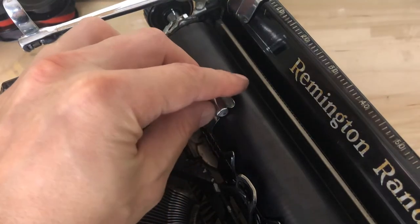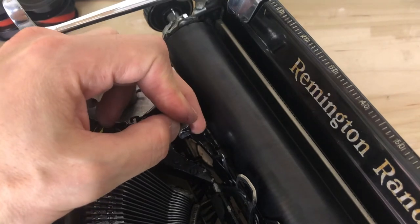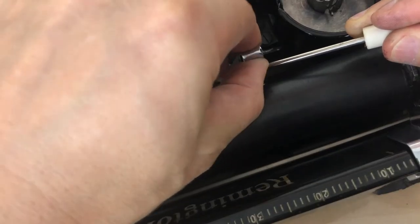These little paper finger rollers here — there are tiny rollers underneath that have flat spots on them. It's nothing major; certainly the platen feed rollers and feet are more important. I've found very few providers — actually no providers — who have the instrumentation required to handle rubber parts this small. If I really think it becomes necessary after doing the major work, I have replaced these before with plastic tubing and I'll show you how to do that either in this video or in a separate one.